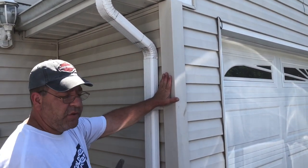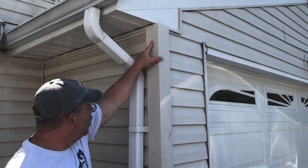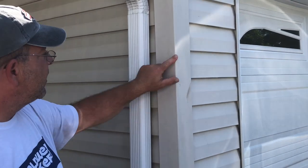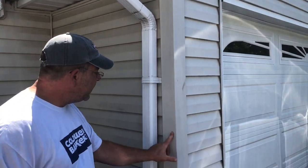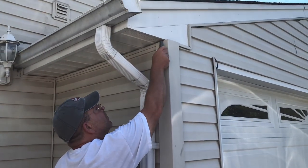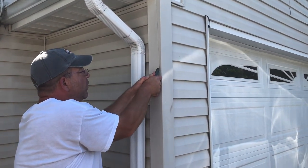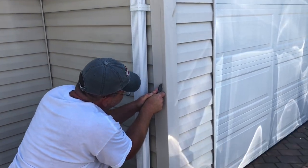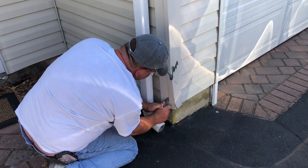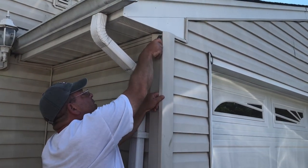Okay, here we go — this is the outside corner I was referencing earlier and I have a utility knife, which is all we need. Just make sure the blade is plenty sharp. What we're going to do is start an incision going from the top all the way down, keeping my cut line about an inch and a quarter from the extreme corner edge. When I cut all the way down, I'll be able to slide out both the left side and the right side of the cutoff. Be careful not to cut yourself — don't slip off your groove. I'm cutting all the way down.